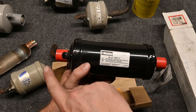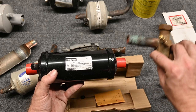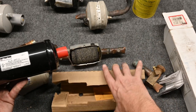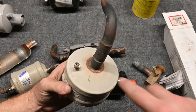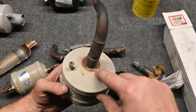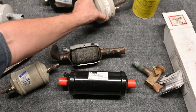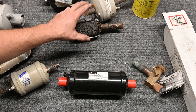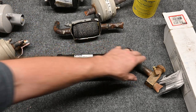So we've got that direction sorted out. This is our port coming in; it doesn't have another port on this side, so we're going to have to use the pressure gauge on the system. Now we also talked earlier about that 72-hour thing, especially with 410A. These are notorious for rusting when left outside — just leaving them outside they're going to end up rusting. Even when brazed in, especially near the ocean around Florida, that bare metal is going to rust out and these are notorious for leaking.